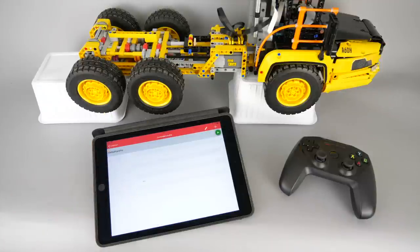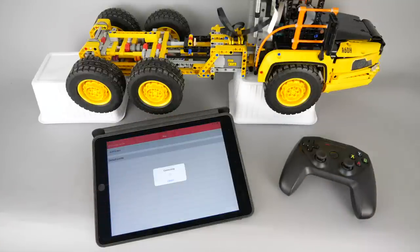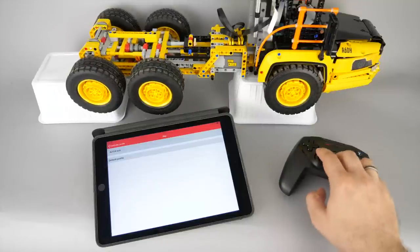Once you have it, you can switch to the control profile — as I said, the setup is documented in my blog post. In this profile we can use the left joystick to control throttle and 2 buttons to switch between gears, while the right joystick controls the steering. There's no automatic shifting this time, so make sure to wait until the motor switches to the next position, as you can mess up the position if you tap the buttons too quickly.